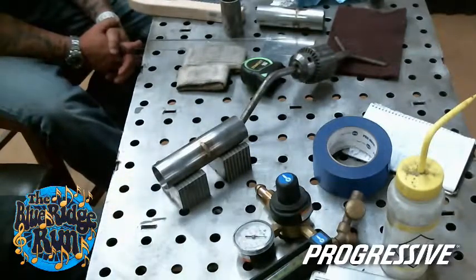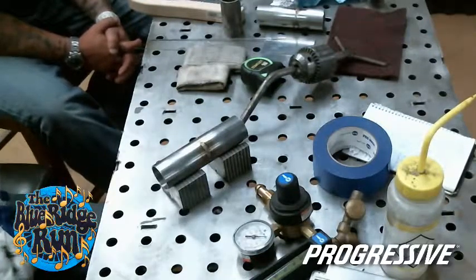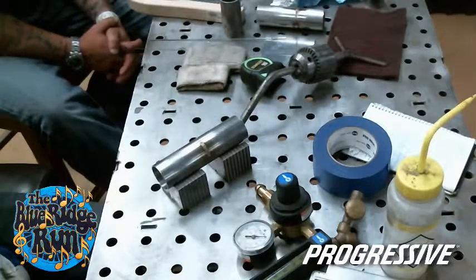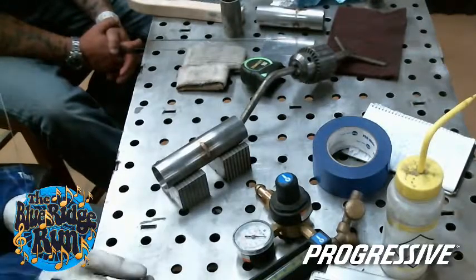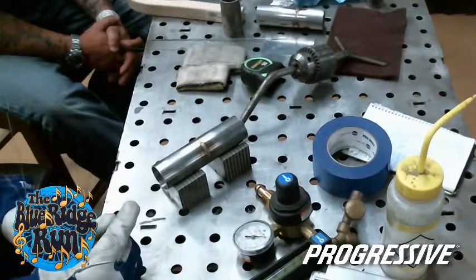And you kind of just lay it in there. You don't want to add material because it'll hump up. You want to actually get the penetration to go down in when you're doing butt welds, because like he was saying, it's going to be on the surface. So the more focalized heat you can get, and the way the tungsten is sharpened will determine the penetration you're going to get also.